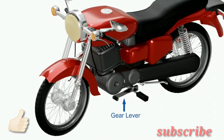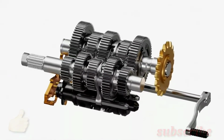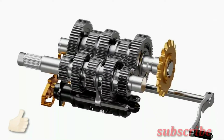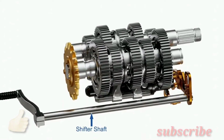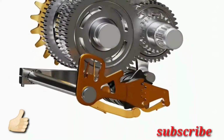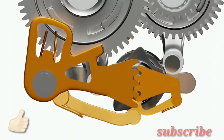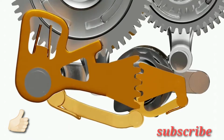In motorcycles, the torque and RPM of a wheel is controlled by manually shifting gear levers up or down with our left foot. A motorcycle gearbox comprises a series of different gear steps, which can be switched according to the requirement. The gear lever is connected to a shifter shaft, and the other end of the shifter shaft is connected to a ratchet mechanism. This ratchet mechanism activates as shown in the animation.